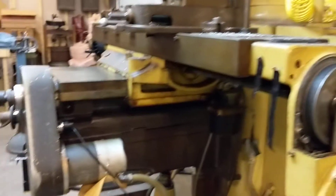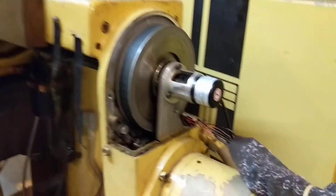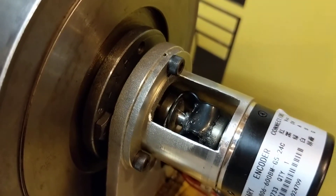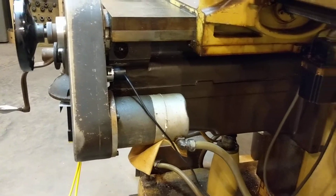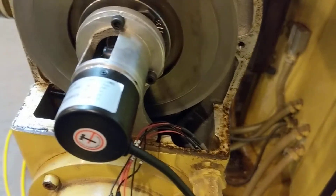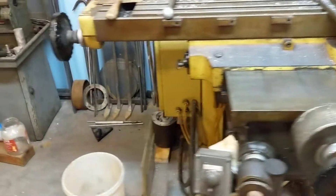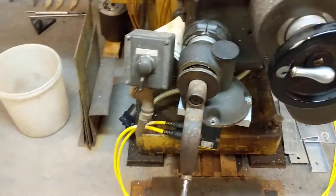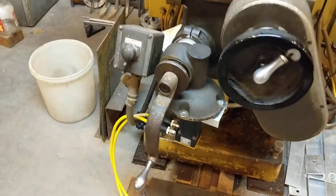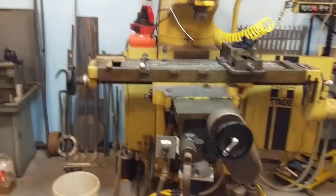These encoders were only sixteen dollars each. Now that I know the machine works on encoders, it's no big deal to spend forty or fifty dollars to get the higher-end ABZ encoders. My new couplers should be arriving today, so if they come I'll probably pull the old resolver wires and close up the X and Y axes. If anyone has ideas on tests I could do — maybe watch my torque or current draw as it's trying to move Z — maybe it is binding because of misalignment; something's causing it to trip.